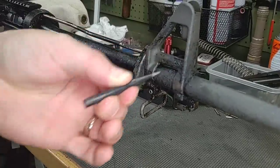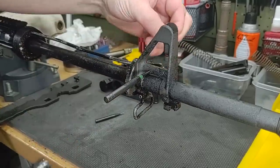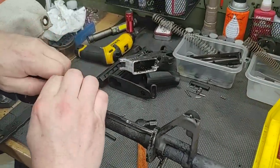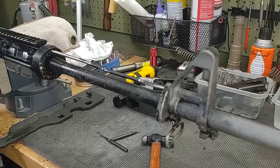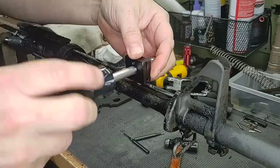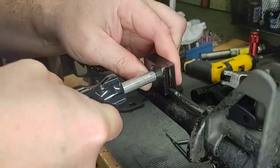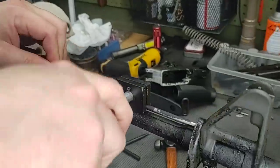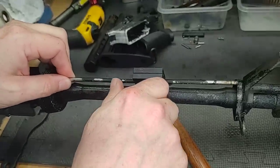Let me get this started and then we'll get it moving. We are going to replace that roll pin. Let's see if the gas tube moves on its own. If it does not, I'm going to have to grab a gas tube wrench. There are lots of ways you can try to grab these. To minimize damage, I like to use a Mark Brown Customs gas tube wrench — it nicely and evenly grabs the gas tube. I can try to move it left and right, which I'm having success with, and then I'll just push rearward to work it out. It is moving.